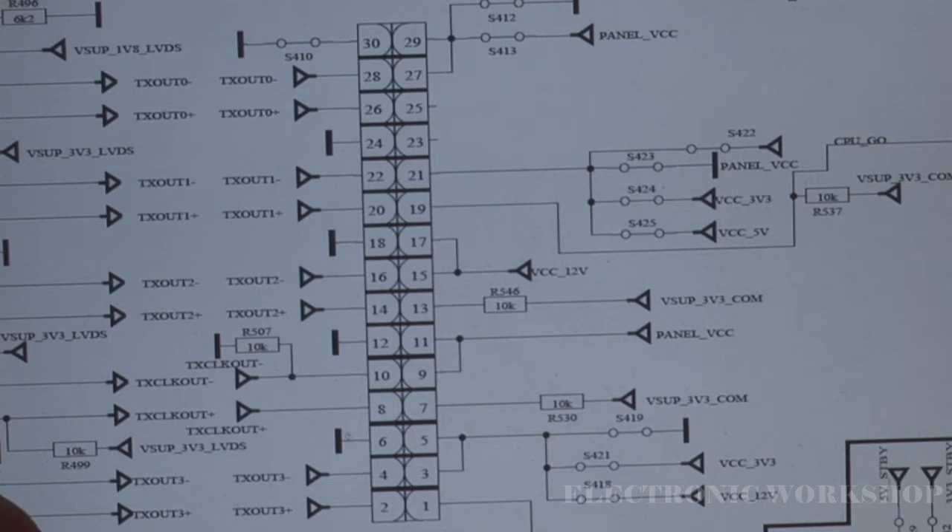The connector is PL404 and you'll see it's the lead that goes up to the screen. I would take it apart and have a complete look at it, but once you disturb it the fault might never appear until it gets back to the customer's house — and a month down the road he's going to be back to me with it and not very happy.